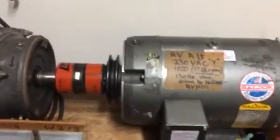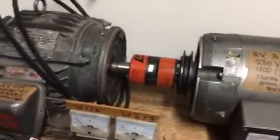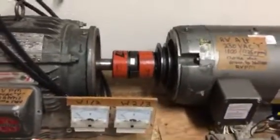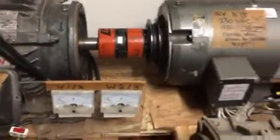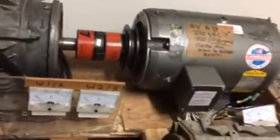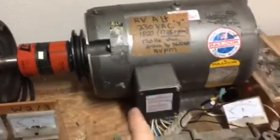Because of the double speed on this side, we end up with 120 Hz output being driven at 60 Hz input, which makes direct looping difficult. The frequency would flip to 120 Hz, this thing would try to speed up, increase its output, or we'd immediately stall out and burn up.